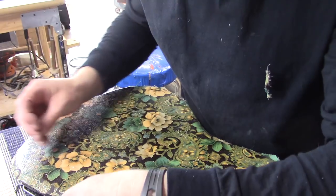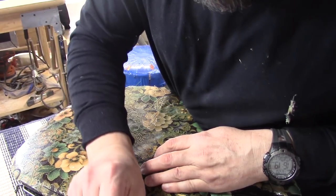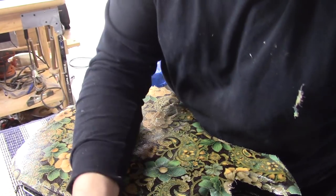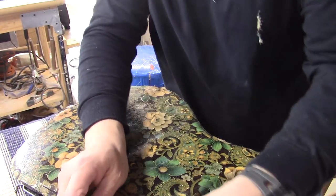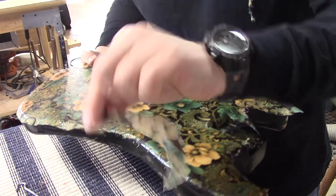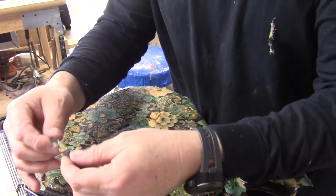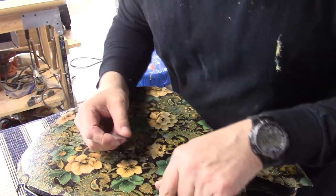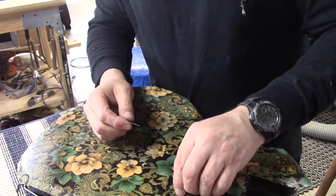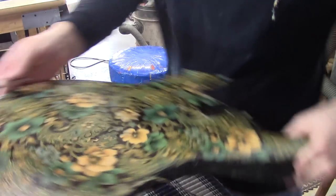The key here is, once everything is sealed up, to get a halfway sharp razor blade and come in and get rid of as much of this stuff as we can. Because for as sealed down as it is right here, this flop-around stuff — if the router grabs hold of this, it could be bad, because this is just like fabric still. This is a little bit more like — you can actually hear it — cut it. This is a little bit more like what fiberglass is like, but this stuff that needs to be trimmed, we want to get rid of that. That's easy enough.